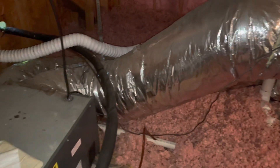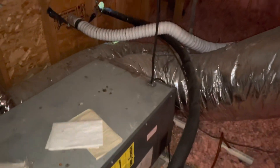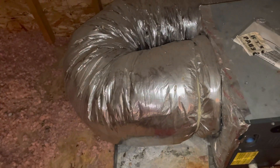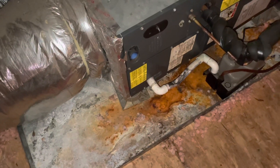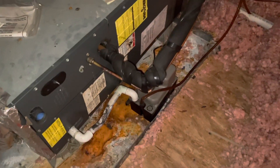The line set's been reran so we should be good. We've got a 14-inch supply duct — we'll just put a square collar right there and move the unit back. Return is 14-inch, so we'll be going back with two ton on everything. New pan — this does have a condensate pump.